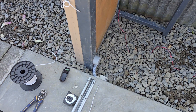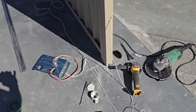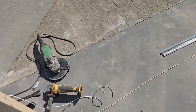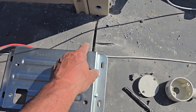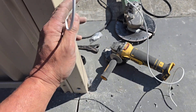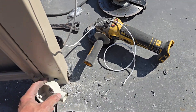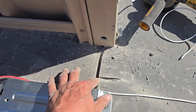Hey team, I just want to show you how to put in a safety beam cable when you haven't put a conduit through. This driveway has been poured but we haven't put a cable under it. The motor plate is going to come and sit here, then the cable will come out in this little trench. There are two cables — one runs here, this is the master cable — and we're just going to use this junction box here and concrete it back down.